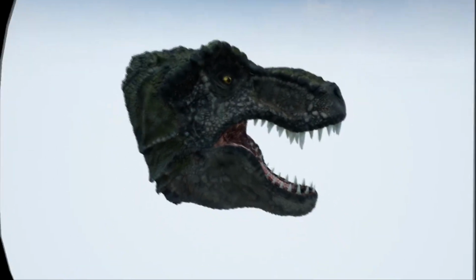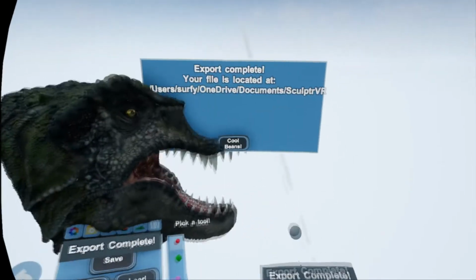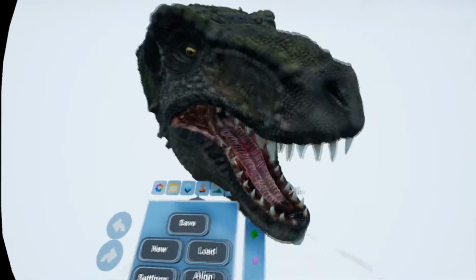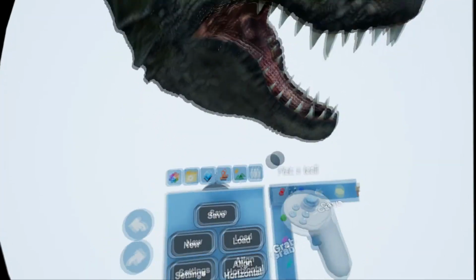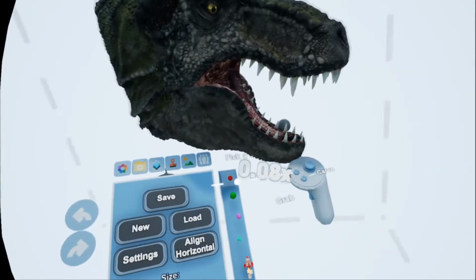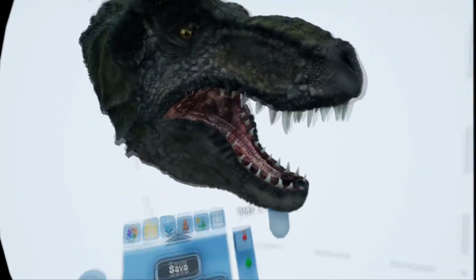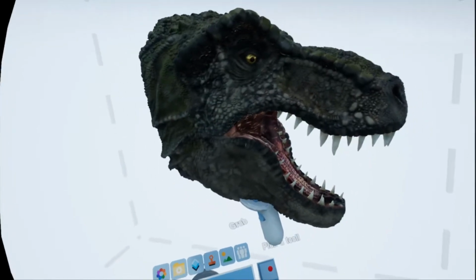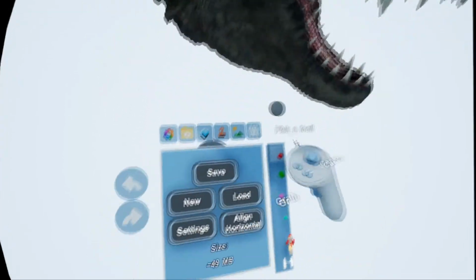That was probably the most time consuming piece, to cut and check each size and then go through to the Cura program, Cura Ultimaker, where I sliced each piece and situated it for printing. And then I managed to print every single piece with no supports at all, just by the way I positioned them and the way that I cut each piece, and minimum infills where I could get away with very little.